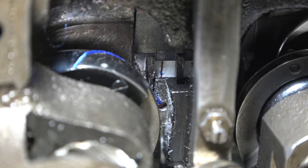I fixed this one. I took a round file and I filed what I could off of it. I did the best I could. You could get what they call string emery cloth, and it's a string form. So I've got to finish this up, polishing those holes off with that string emery cloth. I'll show you how that's done. But this is your Chinese.